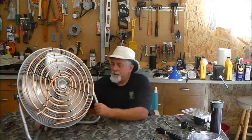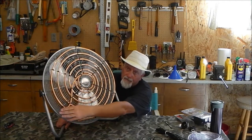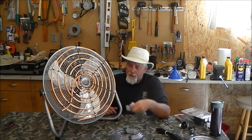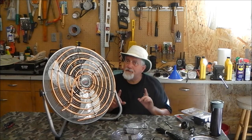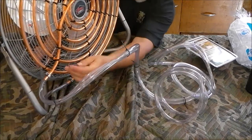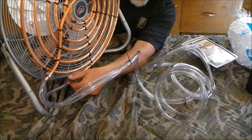On the bottom I've got the tube line running right here, and I've got the exhaust or return line coming out the same way. I'll put the hoses on it and use the hose clamps to secure it, then have the lines wrap around back behind it and zip tie those together to make it look neat. We've got everything hooked up around the fan. I put the hose clamps with the half-inch inside-diameter hose - it's all connected.